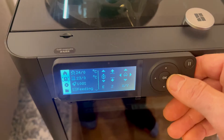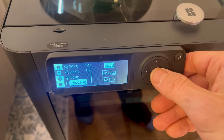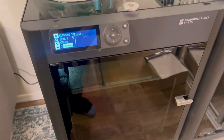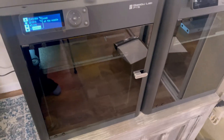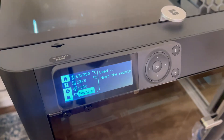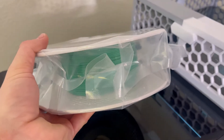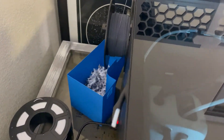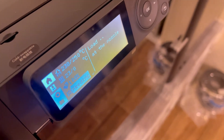The first thing we need to do is load the green PLA. To do that we're going to go into the feeding menu and then we need to tell it to load the PLA. It's going to move around a little bit and heat up the extruder nozzle. Now I'm going to open up the package and install it right in the back through the white Bowden tube that sticks out through the back of the printer. Once the nozzle hits about 245 degrees, it'll do a perimeter sweep again and it's time to load the PLA. We're going to drop the spool right on the back handle.